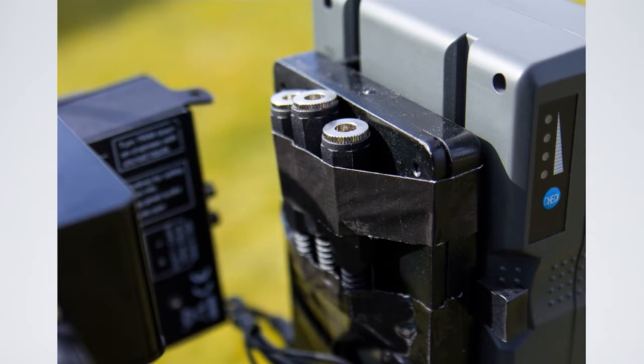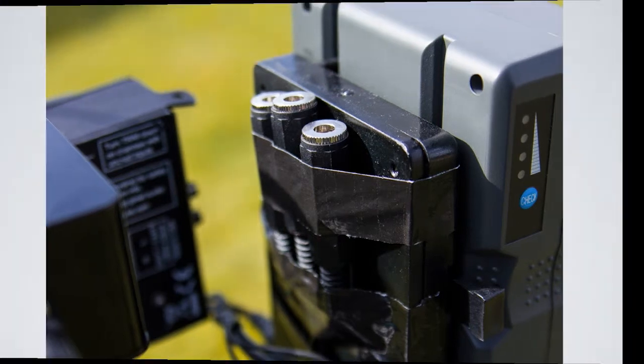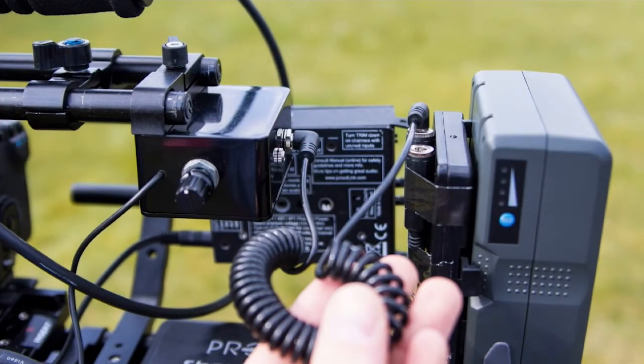Anyways, I've also created something myself here, because the output of the V-plate was only 1 times 7.2 voltage. And that 7.2 voltage is something most of my accessories need. Then I also had 5 voltage, but that just wasn't enough. So I was able to split them, because it was such a huge, very powerful battery, so I can just split it in 3, like I did here. That's a little do-it-yourself there.